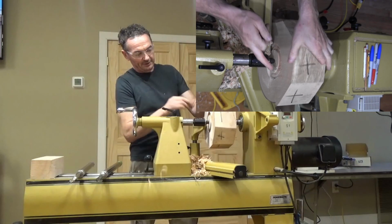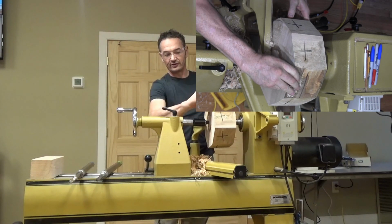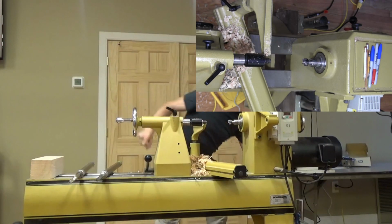So that one's prepped, and you see it doesn't give a good finish on this surface. It does tear out, especially on crazy grain. This is not the ideal gouge. I'm going to show you what gouge is good for there, but I didn't want to pick up two tools. Not if I don't have to.